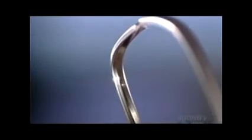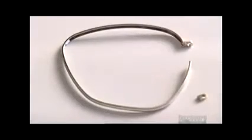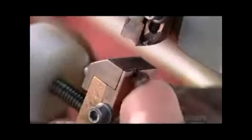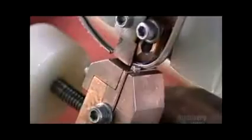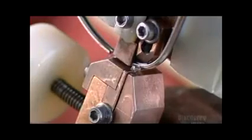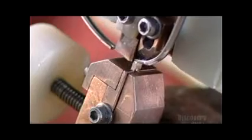The lenses will fit into pre-cut grooves on the inside. A small part called the insert connects the two ends of the eye frame, holding them closed around the lens. To attach the insert, they put it in a clamp, then position the eye frame just above it. They apply a cleaning agent called flux, then filler wire. An electric current heats the wire, metal frame, and insert until they all melt and fuse together.